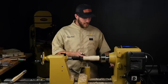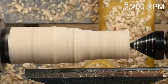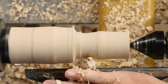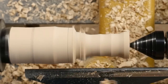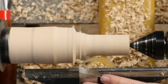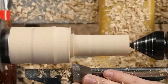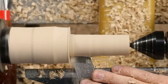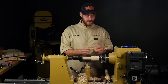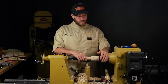Now that our blank is round and it's in a chuck on a tenon, I'm going to speed this up a little bit and bring in my tool rest for a little more support. The speed went from about 1,800 RPM — now we're at 2,200 RPM. I'll use my skew as a peel cut. These dimensions I put on here are a fairly rough dimension — just based on the style that I liked. You can play around with the length of the handle versus the overall diameter and size of the head. You could shorten it and lengthen it out — there's so many different varieties of baby rattles out there, so play around with different styles.